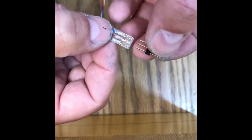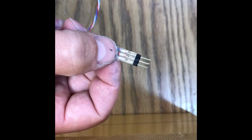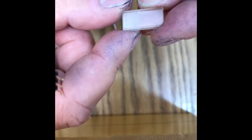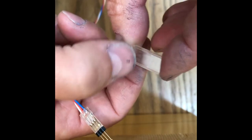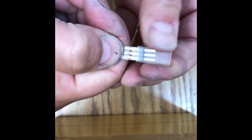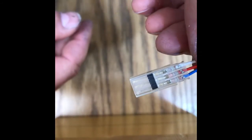Then go ahead and grab one of these male pin pieces and slide it in — goes in all the way. The next thing is the housing piece. You can see there's a little V in the middle — the V goes on the top, with the pins up, and just push it into the housing and click right in like that. Sometimes you have to push it a little bit — there we go, click, boom, all the way in. That's a connector. These go pretty quickly.